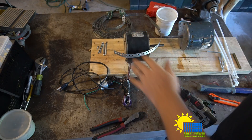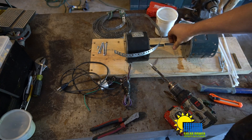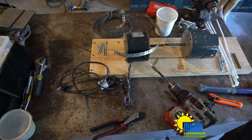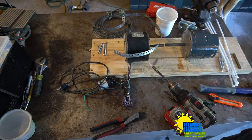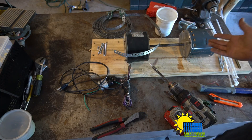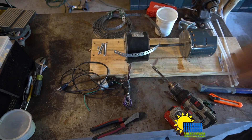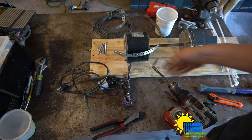We've got two motors - this one is just like the wind turbine motors. I'm not sure exactly what was wrong with this one. These motors are abundant in the heating and air conditioning industry. You can get them pretty cheap - go to an HVAC company and say you want a bad modulating motor, take the module off the back, and you've got a motor. Higher amp, higher horsepower is better. This is a half horsepower motor, which is a pretty good size, but they also have three quarter horsepower, which is much better. Bigger horsepower produces more electricity and handles more amps without burning up.